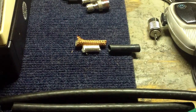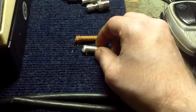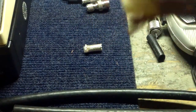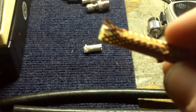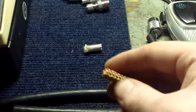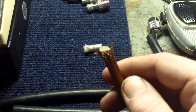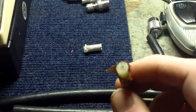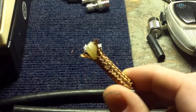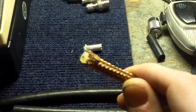I wanted to show the difference between RG-213 and RG-214 mil-C-17D. For years I have been faithful to RG-213. As you can see, the braid is very loose — there's only one layer of braid and a stranded copper center conductor. I've used this for everything up to GMRS frequencies; it doesn't work too bad but doesn't work that great either.